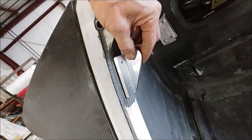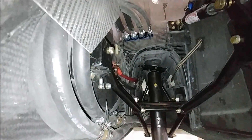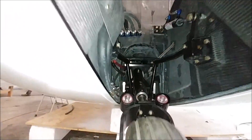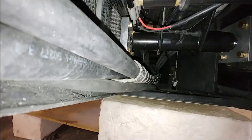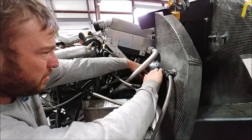Dan's been doing a great job moving through all the different bits and pieces with all the systems. Here are the lines for the AC — he's got a bracket, a little plate, holding them in place on the left. We had to spend almost a day trying to get things sorted out halfway down the keel because the conduits were pushing apart and touching the aileron cables. We got down there with some fishing line and got a cable tie around those, also cable tied to the floor so it wouldn't move.